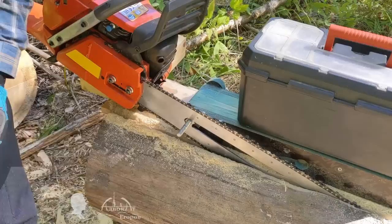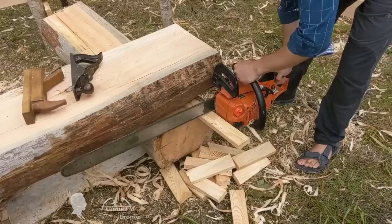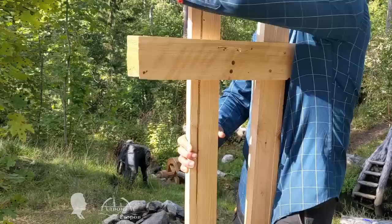It is not easy to mill a 50 cm log with a 40 cm guide bar. This is why I brought two extra-long guide bars that I made at home. Now, it would be nice to choose a proper weight for the carriage and find a way to secure it on top — and you don't have to go far to find some pieces of wood to keep the weight in place.